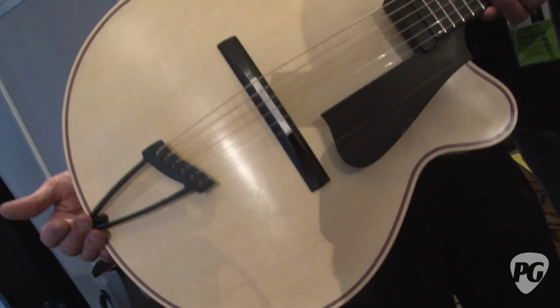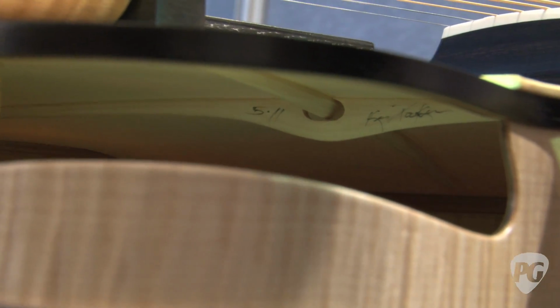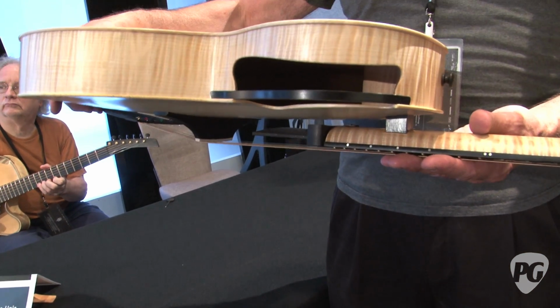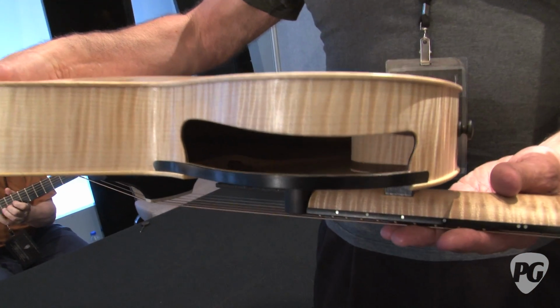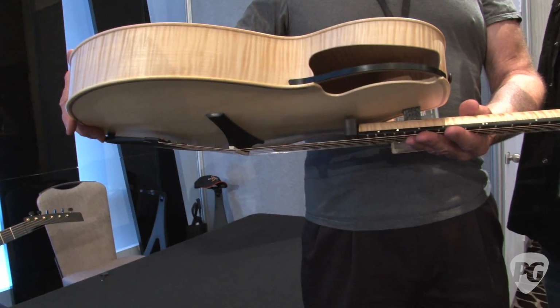And I don't know if you can see inside, if you have enough light inside, but the tops of my guitars are very, very lightly braced, and it's one of the ongoing learning things that I do as a builder. I'm just trying to figure out how to get the top to behave in a unified way so that it's as energetic and efficient as it can be. I think the loudest guitar isn't that much louder than a regular guitar. Do you know what I mean?